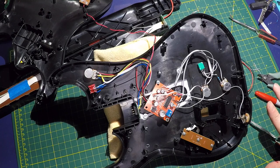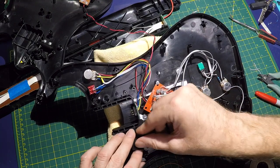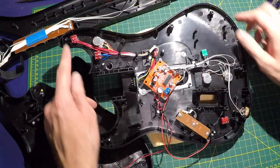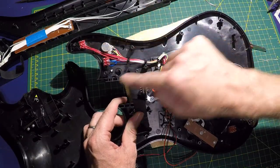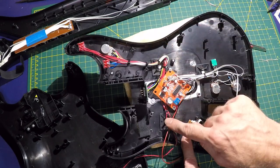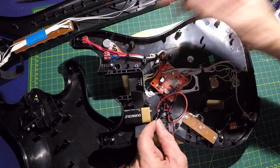What am I missing? Oh, and then finally our battery. That is just going to be a simple 9-volt clip, and I'm probably going to attach some Velcro in here that can just hold the battery in there. Okay, so I added a power switch up here to toggle power. And I routed the 9-volt on one side and then the 3-volt on the other. Just 9-volt for the delay and then 3-volt for the cassette player. I also tidied up the wires with some zip ties and little cable tie stick downs. I hot glued a piece of Velcro here for the 9-volt battery. And the 9-volt battery will connect there.